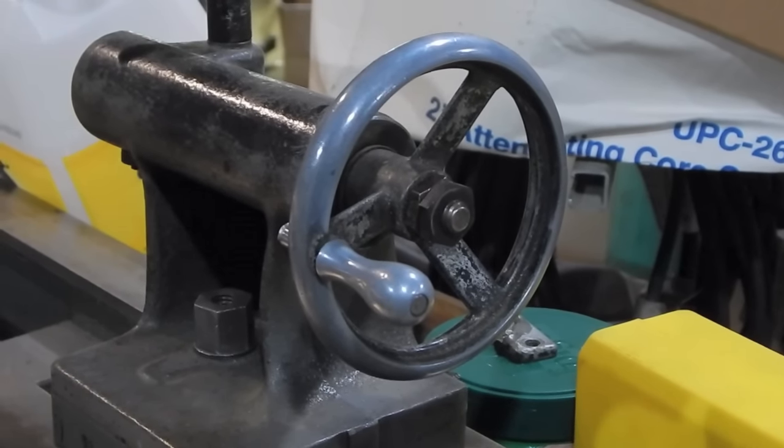Not completely, but a little bit further. This hole is going to have to be enlarged to accommodate the two nuts that actually hold this piece on. So this will be put back on, the nuts will be tightened, and this newly made piece is going to slide over this. From the back I'll figure out a way to put maybe some standoffs and some clamps — sort of like the way the hold-downs work on a mill table — something along that line should work perfectly fine.